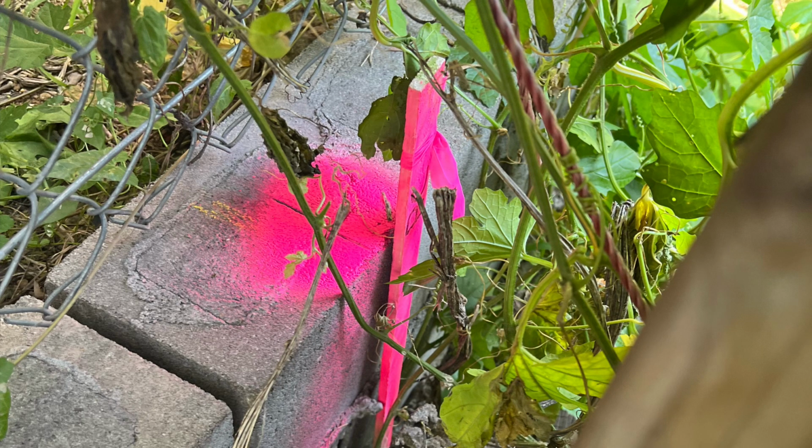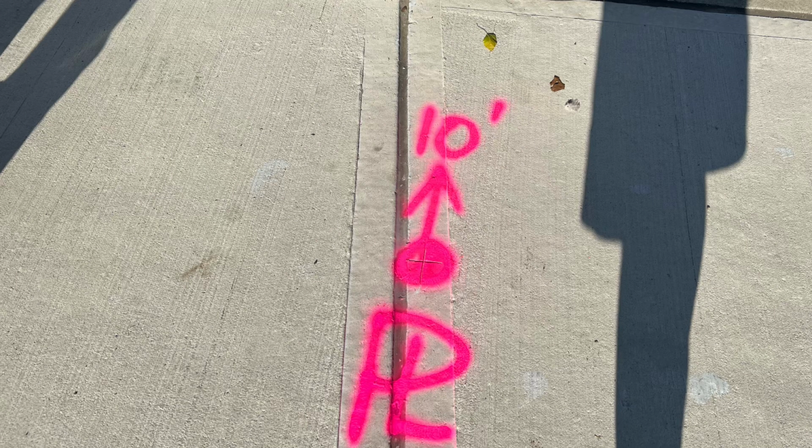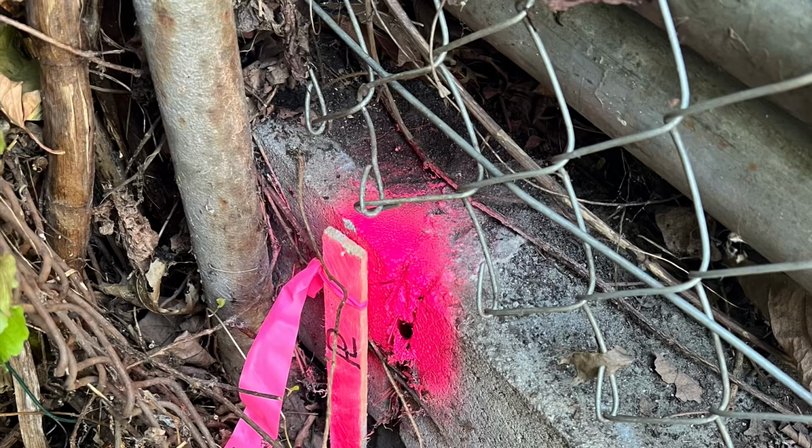In this video, we're going to show you how to install a fence 100 feet long. First, you need a surveyor to survey the land and mark the boundaries using a pin. So I had 4 pins, one to the right, back and left, and one to the front, right and left. This is important. You don't want to put up the fence on the neighbor's property.